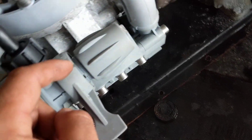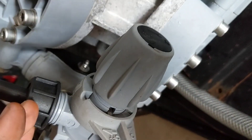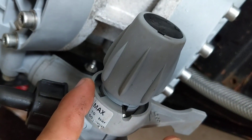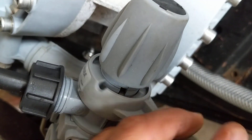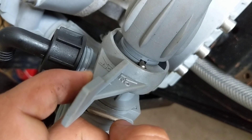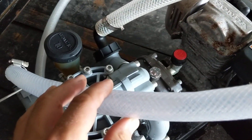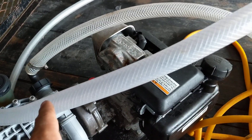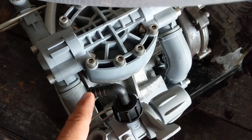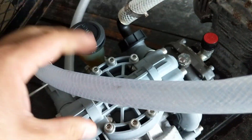This is going to be your unloader valve. On this unloader valve you have this adjustment — this shuts your unloader valve, this opens your unloader valve; you want to leave it open. If you shut this off, you will gain more pressure and get more distance whenever you let go of the trigger gun, but this is going to explode because it's not bypassing the pressure back into the tank. This bypass is intended to relieve pressure from the hose so it doesn't over-pressurize and rupture.